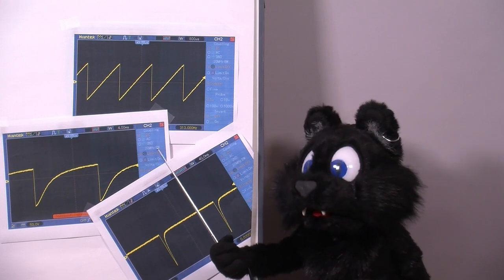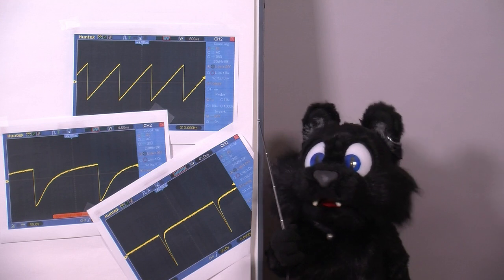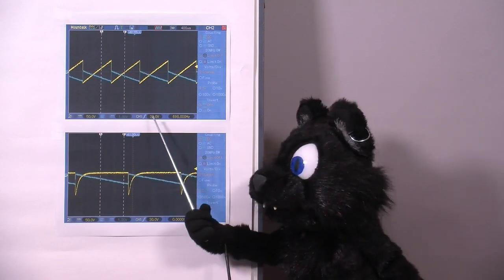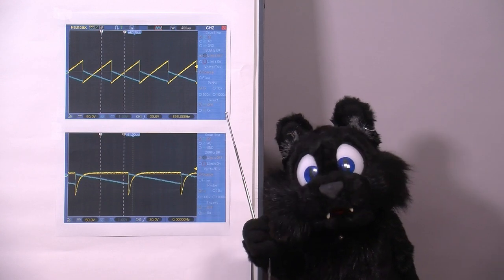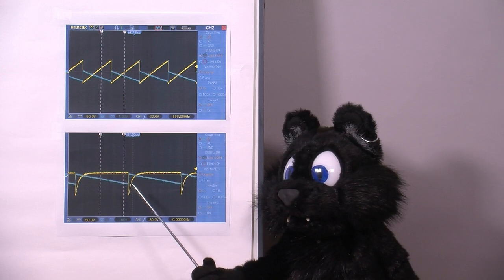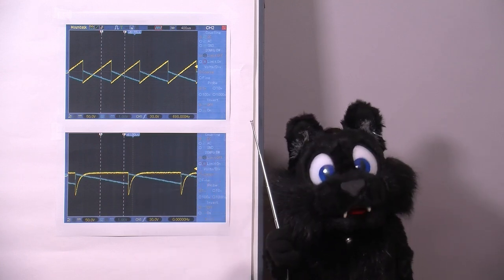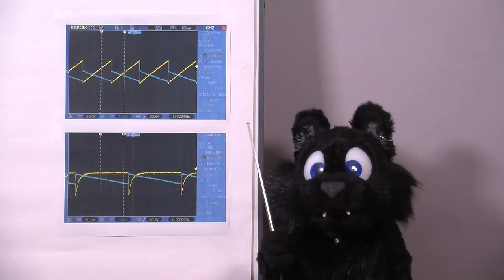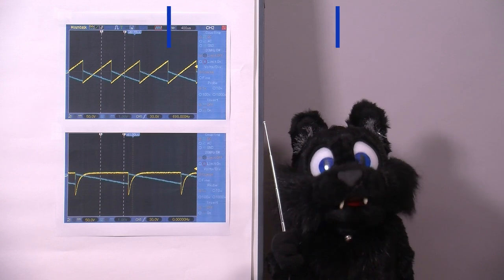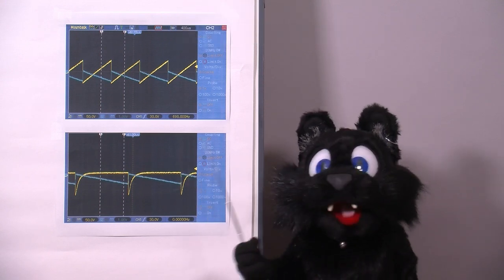And after much reverse engineering, because I could not find a schematic for the plugin, I finally found the error. I had one of my scope channels connected to the output of the module and used the second channel to poke into the circuit, which seemed to be working just fine. So I assumed some coupling issues from the plug-in socket to the main unit, and then it hit me. Classical PEBKAC error. The keyboard in this case being my DSO.